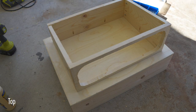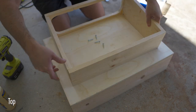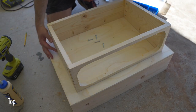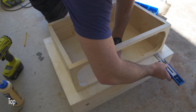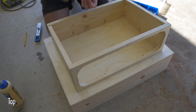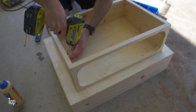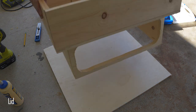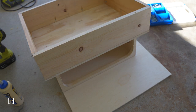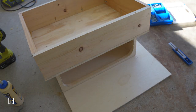Once the top is complete, I place it on top of the base, make sure it's centered, and then connect everything together using wood glue and pocket hole screws. Once the top is joined to the base, I then place it onto another sheet of 1 and a half inch thick plywood and trace out my cut line using the same method as before. This time, however, I give myself about an extra half inch, which will provide an overhang to further protect against rain.